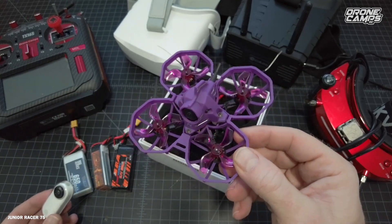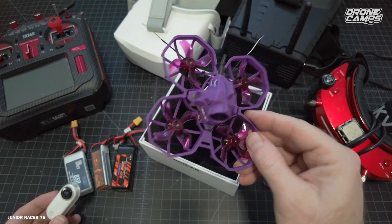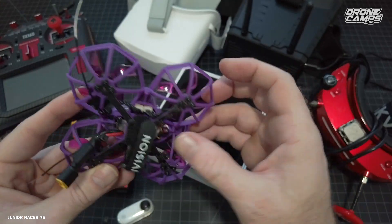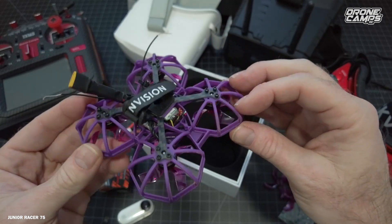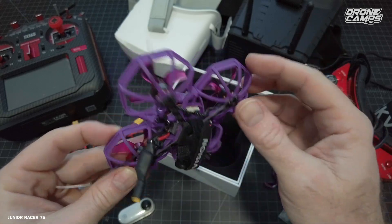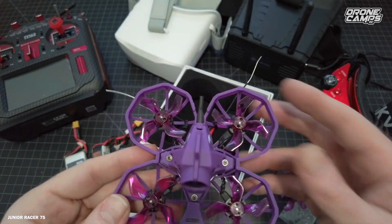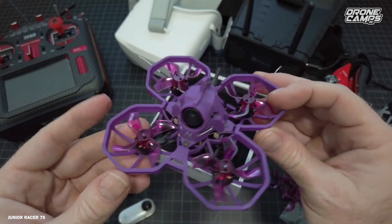You can build gates and fly indoors and have a lot of fun. Beta FPV has some really awesome gates for smaller stuff like this. We have a very sturdy frame here — a plastic rubber-coated type of frame with eight struts on each of the prop guards. It's kind of a hybrid — carbon and what looks like ABS-type plastic, possibly polycarbonate. It has a removable canopy. It's running the Caddx Turbo EOS 2 camera and a 200 milliwatt VTX.